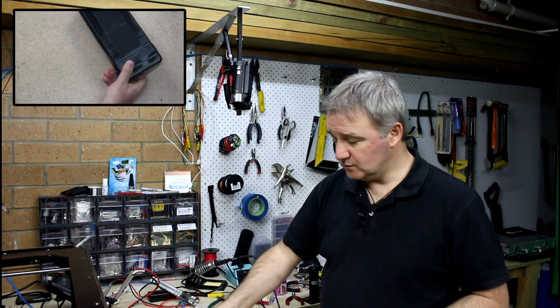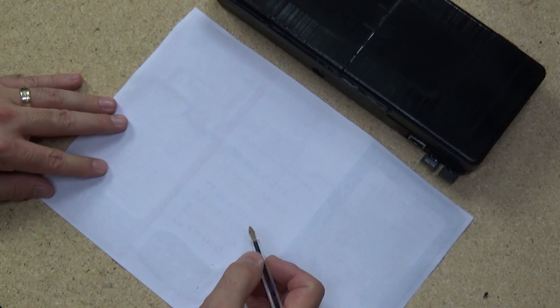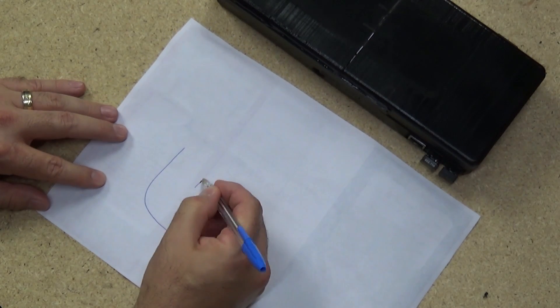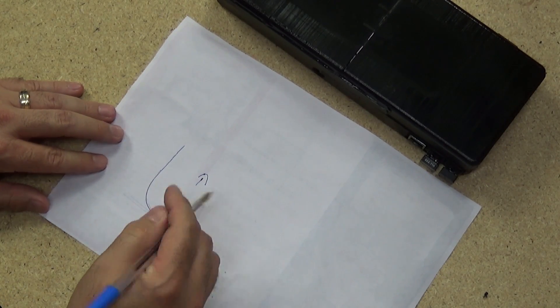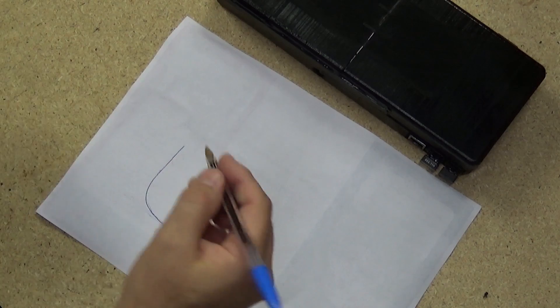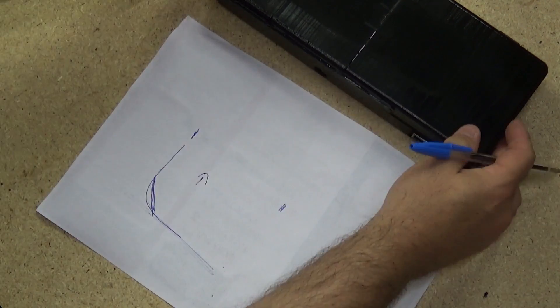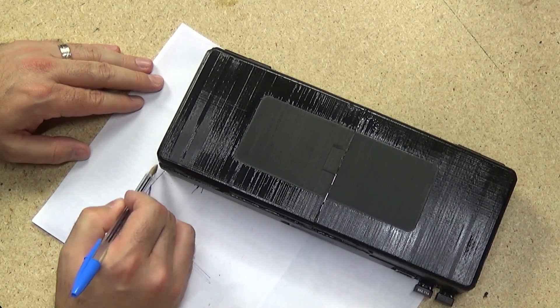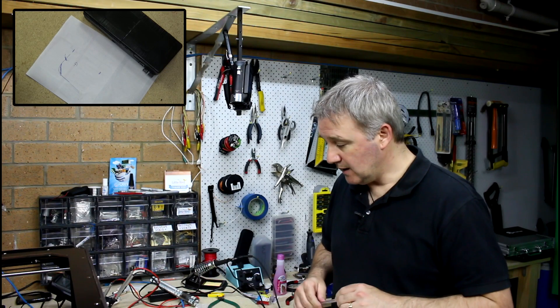Another main lesson: printing parts vertically. If you print a vertical part that has a chamfer or curved edge, I've noticed it throws about half a millimeter out between measurements. When you're talking about half a millimeter or a millimeter tolerance for fitting in the display, that's enough to cause the display not to fit — you have to get the Dremel out and cut some space, which is what I had to do. Lesson learned: make it a hard 45-degree chamfer on those edges rather than rounded, which removes the tolerance problem.